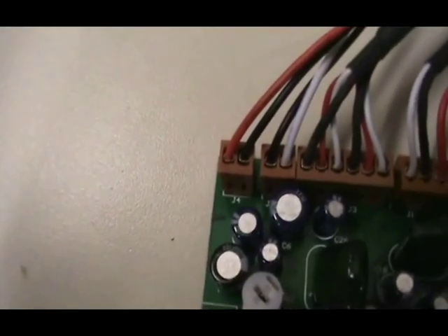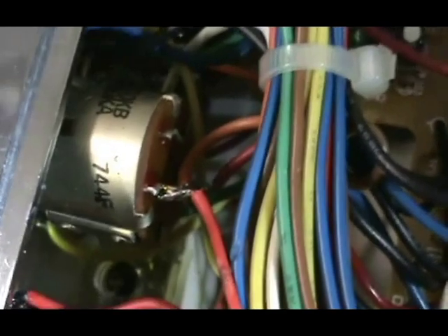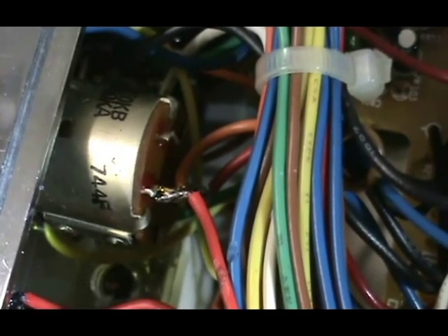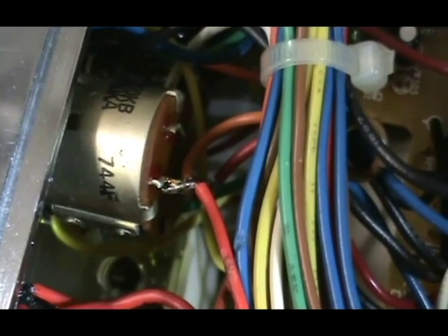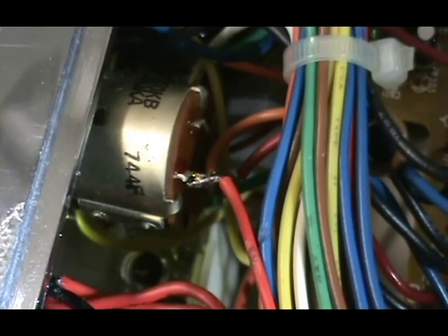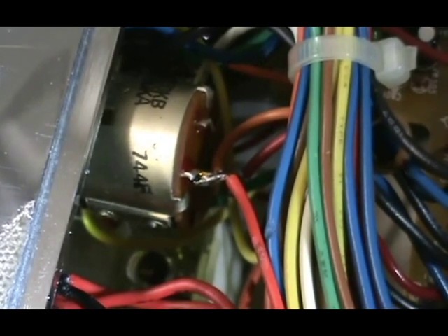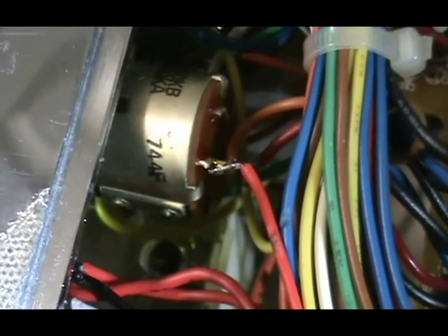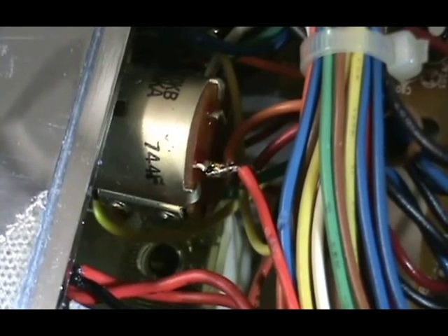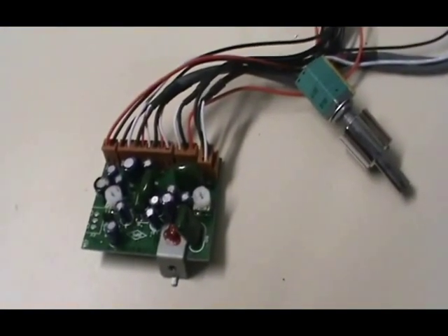We're done with the microphone plug. The next step is the red wire from J4, which applies power to the echo board. That power wire runs to your volume on/off switch. There's a red wire and an orange wire connected to your volume on/off pot. The red wire is the hot wire — active any time power is attached to the radio. The orange wire is the on/off wire; when you turn the radio on, power flows through the pot into the orange wire and out to power the board. We've attached the red wire from J4 to the same output as the orange wire, so the echo board won't get power until the radio is turned on.